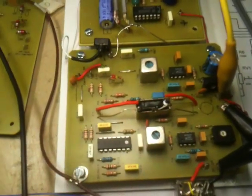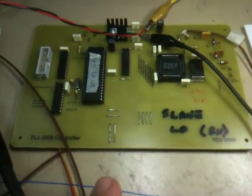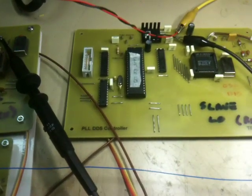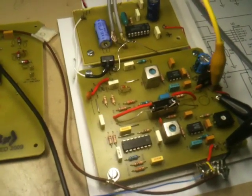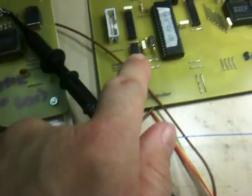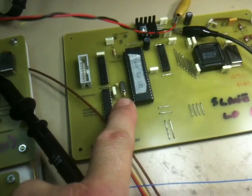We have an IF of 455 kHz, so the actual receiver local oscillator is tracking in step from the transmitter at 455 kHz above the transmitter frequency. The actual local oscillator on the receiver is tracking high. We've got the two transmitter and receiver DDSs in synchronisation with this three-wire cable. The master is providing a synchronisation pulse for the slave PIC.